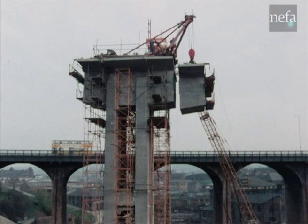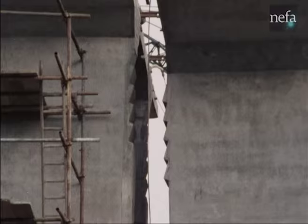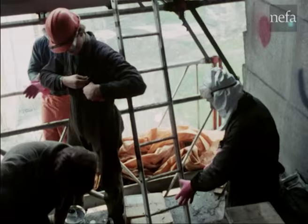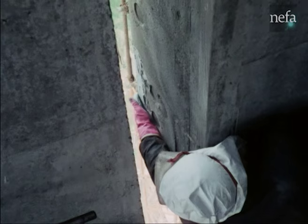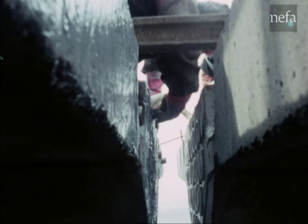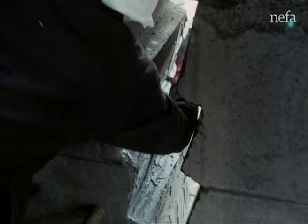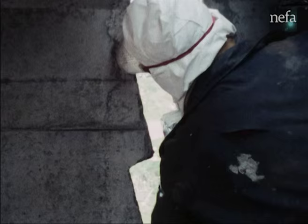The end faces have already received a light sandblasting in the stacking yard. This and subsequent segments are added by gluing and bar stressing. Epoxy resin two-part adhesive is not mixed until the critical moment. Protective clothing is worn during the application of the resin by hand. Speed and skill in the jointing process are essential — too slow and the glue goes off. Spread too thickly, the glue squeezes into the stressing ducts; too thinly, the grout seal between the ducts is incomplete.